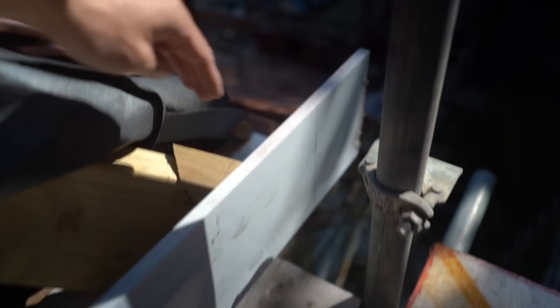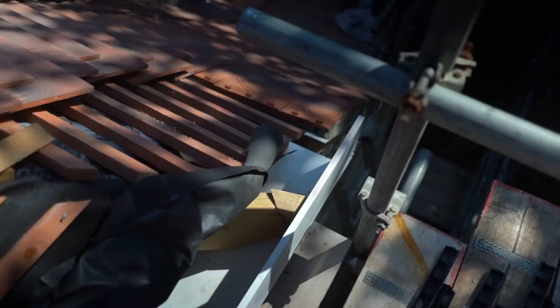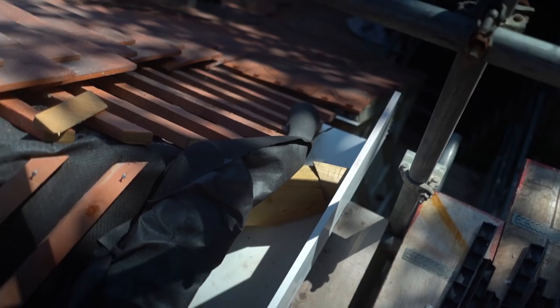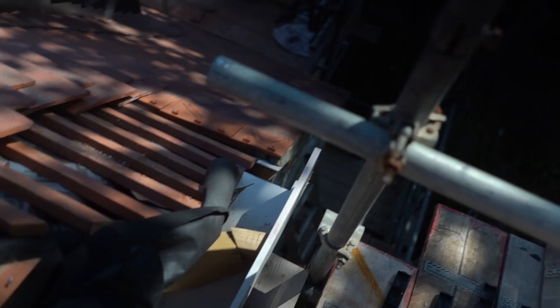And then I have to work out this side to see exactly what's going on, because a lot of those tiles are going to be behind the fascia and soffit, which I don't think is good, but that's something I had to scratch my head about and try to work out. Maybe I could overhang. I don't know. I might have to just box that section in on the top and the side, but that doesn't seem to make much sense to me, because I don't really want to cut this at an angle going down in line with it. I don't mind putting a bit more batten on to have it coming over, but then you'd have to have guttering on the other side, and I've never seen that before. There's a way of doing this, so I'm going to try and tackle that.